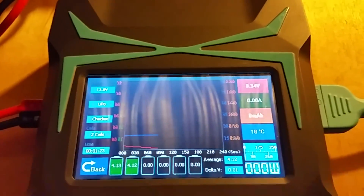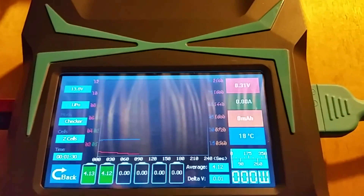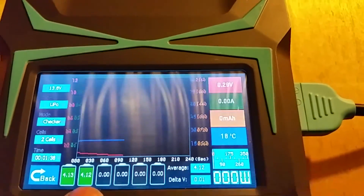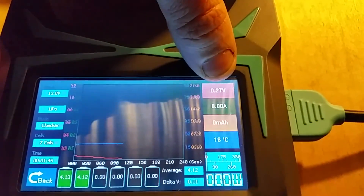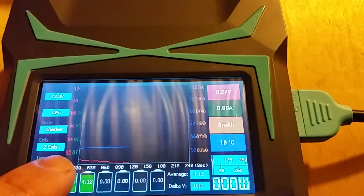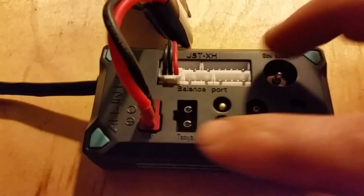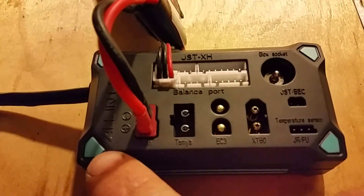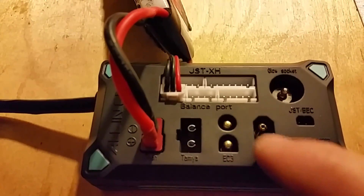A working version of the IMAX 350 charger. The battery is charged at 4.13 and 4.12V, but the battery input voltage at main charging is only 0.20V — started at approximately 0.4V and still dropping. When you open the all-in-one box, the contacts aren't very good. They've coated everything with a varnish, and unfortunately the terminals got coated too, so you're not getting good contact.